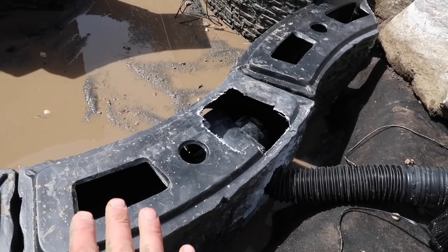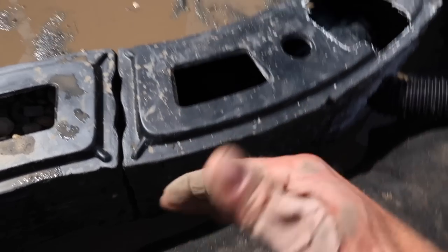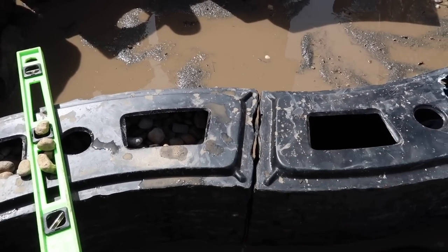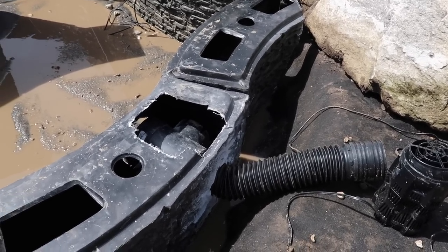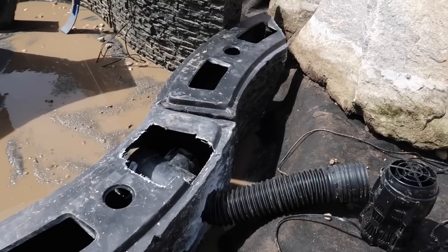Get these things filled with gravel, get this trench back behind it filled with gravel. The reason we have this trench is we always over-excavate, so that we give ourselves plenty of creative freedom and maneuverability with these things and aren't really tied to the excavation to determine where we're going to put things. Always over-excavate. You can always move those rocks in or out, or the walls in or out as you please, and then you can backfill with gravel accordingly.